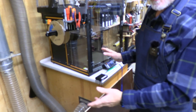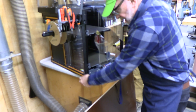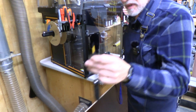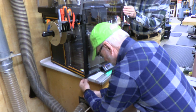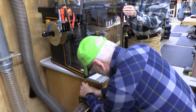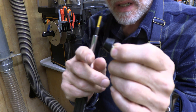So here's my printer, the Prusa XL. We're going to just move this so that one of the feet is hanging off. It is secured with a 2.5 millimeter metric hex screw, and we use a metric hex bit to take it out. So we'll just unscrew this foot. And look, all it is is a really small hard piece of plastic.